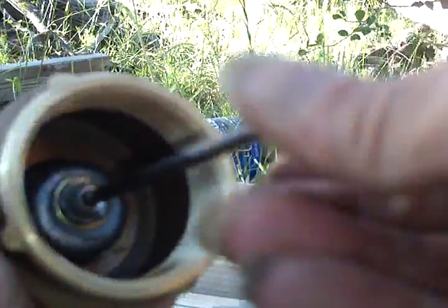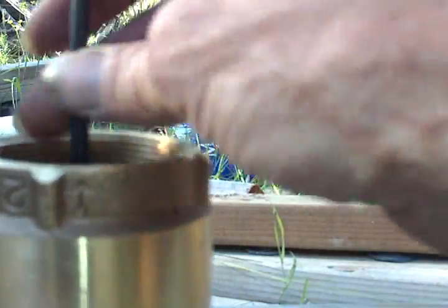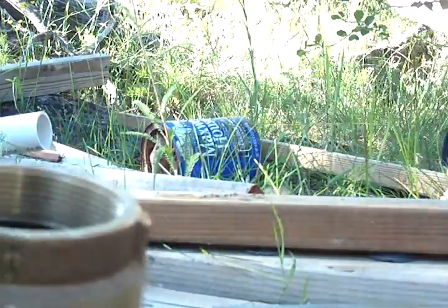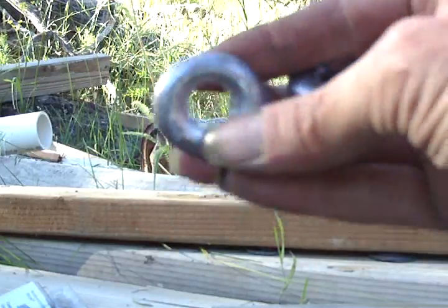Springs are a royal pain. I have too much weight on this one so it's pumping too slow — it's letting too much water through and the flow coming down the hill can't keep up with it. I'm using these donuts right here; these are modified fishing sinkers.